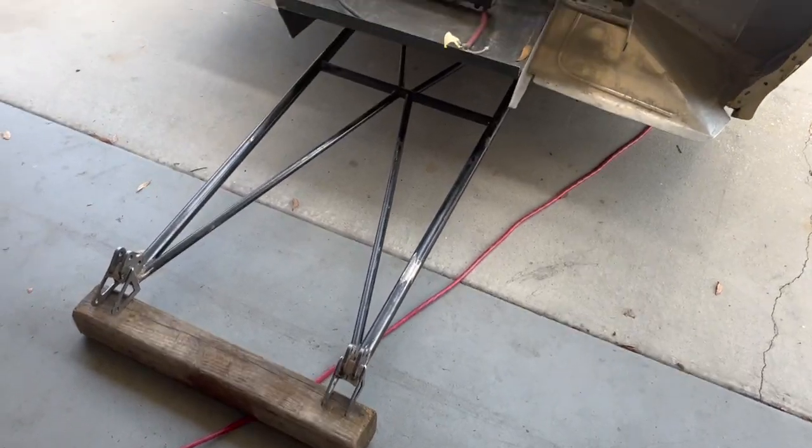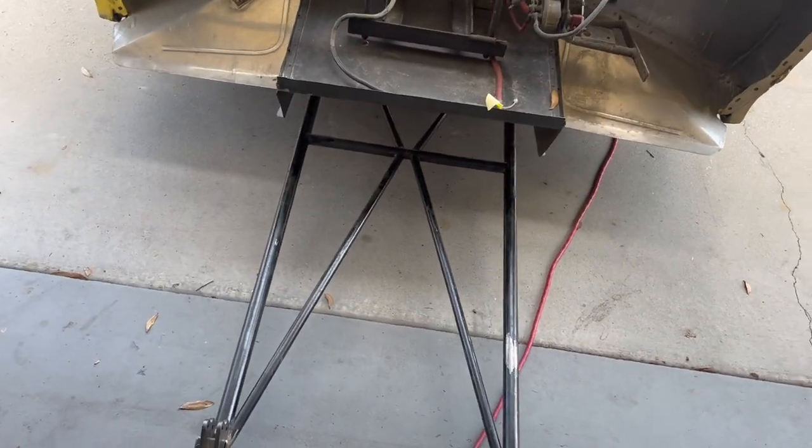So last night I was tinkering with wheelie bars, and the top bars need to be shortened, which I'm working on right now. I have some stuff coming for the upper bars, the upper heims, because if I'm going to shorten the bars, I need to get a new heim and different heim inserts. And they're on the car right now. Actually, I just have the bottom bars on.